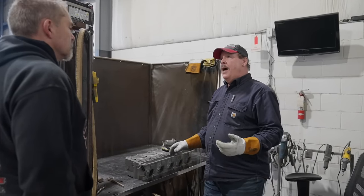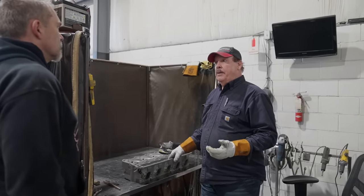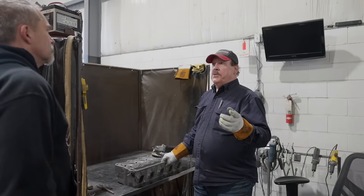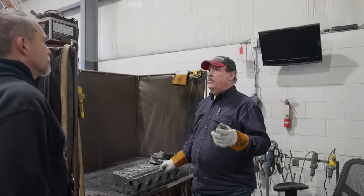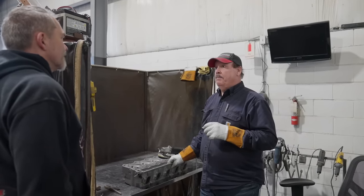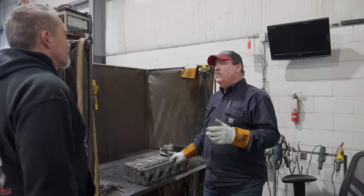Okay. And when we weld copper, we weld with pure helium. I use laser grade helium. So on each one of these furnaces, there's two furnaces. Each one will consume about 90 bottles of helium to weld that copper pipe. Really? Yeah, so it's a huge expense.